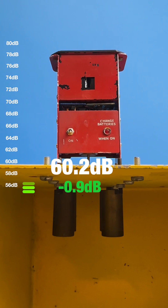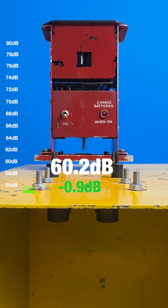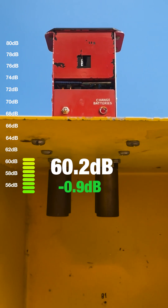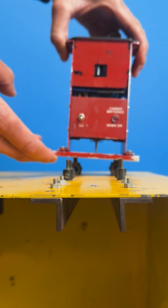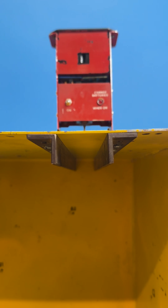Also, adding masses at the connection point helps stop vibration going from the source into the receiver. So in many cases, a good isolation is a combination of a reinforced receiving structure and soft mounts.